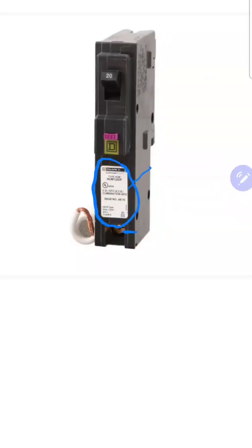Sometimes on the front it will tell you what size wire you're legally allowed to use for that breaker, because you're not allowed to use all wire sizes. This breaker might only hold 14 to 10 gauge wire, or it might hold 14 up to maybe 8 gauge. When you get into 60, 70, and 80 amp breakers, they might hold from 14 gauge all the way up to 6 gauge or higher depending on the brand. But you're only legally allowed to put the correct size wire for the size breaker.